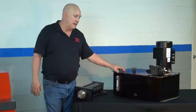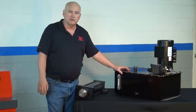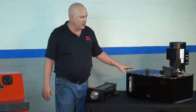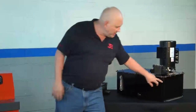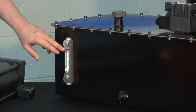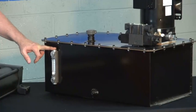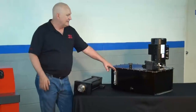This is our hydraulic tank. On our original prototypes, we were running a seven gallon tank, and the more we looked at it, it just didn't fit the character of the machine — everything has to be heavy duty and it was made out of 16 gauge metal. So what we did was design our own. This one is right at about a 14 gallon capacity, a half inch from the top. It's made out of 12 gauge steel and it is double welded — welded on the outside and the inside to help prevent leaks. We have a temperature and level gauge; it will indicate if you're low on fluid. It also has a temperature gauge in Fahrenheit and centigrade so you can monitor the temperature of the hydraulic oil — useful if the machine is in an automated assembly line being controlled by external sources.